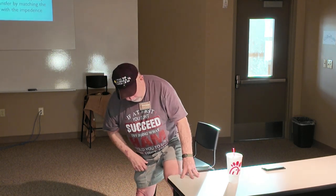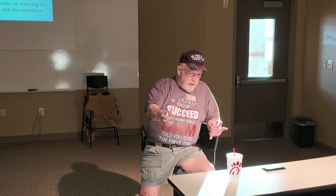You know, years ago, us old timers very seldom ever saw one of us old folks have a tuner. And the reason was that we had tube radios. And the tube radios could handle from about 40 ohms, probably a little lower than that, probably 25, 30 ohms, to about 120, 150 ohms. Because on your tube radios, you had a tune control that you tuned the final amplifier to resonance, and then you had a load control that basically matched the antenna impedance to the radio output.